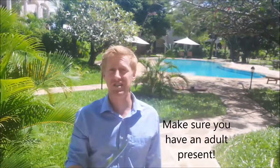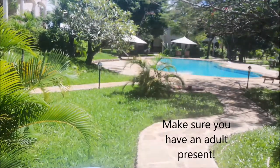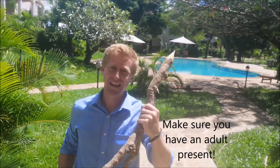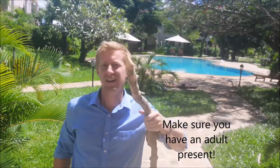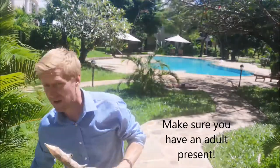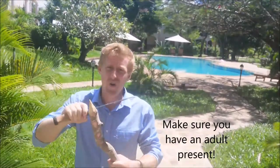I'm going to make my Sharpedo out of it. This is a great opportunity because I get to use some tools — finally. Look at my knife. It's my Mr. Maker knife. I'm going to whittle and I'm going to saw off the Sharpedo bit and whittle it down. I'll do most of the shape while it's a big piece — you really want to be shaping it while it's all one piece because you can hold it in lots of different ways and lean it up against things so whenever you're working with it, you're far away from the cutting edge. You're always cutting away from you, never towards you, never ever towards you. And always make sure your hands are behind the cutting edge — never cutting towards your hand.